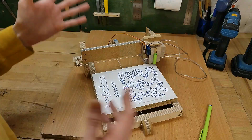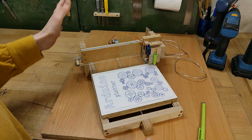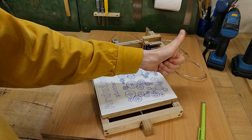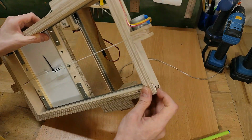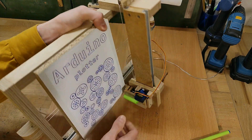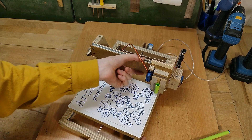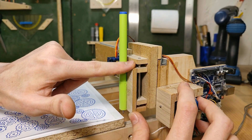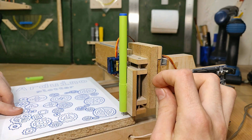Now let's take a look at the good and the bad of the mechanical design. I know it's a little overkill for just a pen plotter, but I quite like the overall design, as it's kinda compact and therefore sturdy, but also very simple and effective. It basically just consists of a plywood rectangle screwed together at the corners, in which the drawing surface slides back and forth to make the Y-axis. Then we've got these side pieces also screwed to the rectangle, to which I've attached a strip of MDF which basically acts as the X-axis. The little X-carriage is also made from MDF, and has this tiny little Z-axis on it which slides up and down by about 10mm on a bunch of metal rods. If it wants to draw, the servo just drops it, and to stop it just pushes it up again — very simple and effective, just relying on the weight of the Z-axis to push the pen on paper. May not work with pencils, but that's linked to a con I'll talk about later.